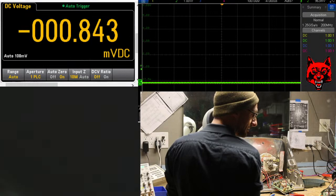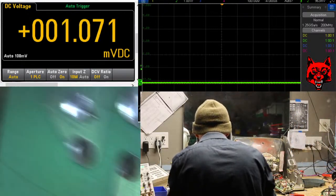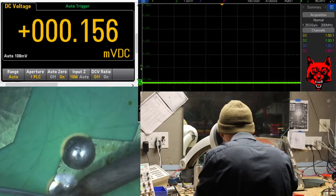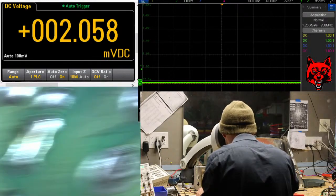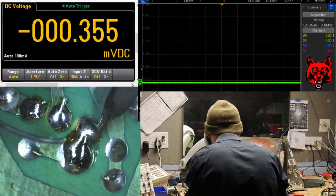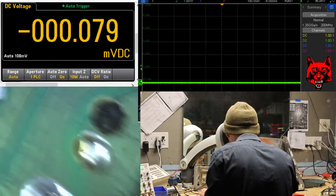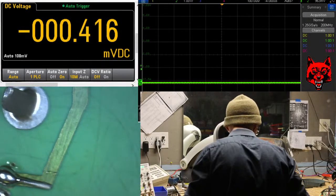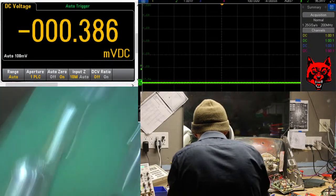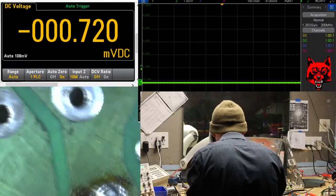That's not around here. Okay. Here we go. As I'm doing this too, I'm going to look for possible leads to clip that aren't going to fold over or hit anything. Sometimes they miss it even in the factory. Scan the whole board. I don't skip anything. Raster ones take a little bit longer, if you can imagine.